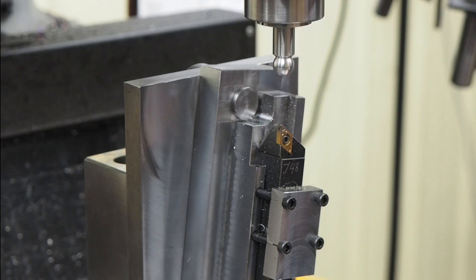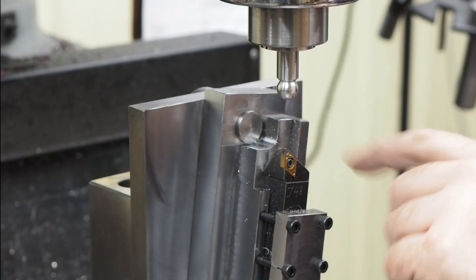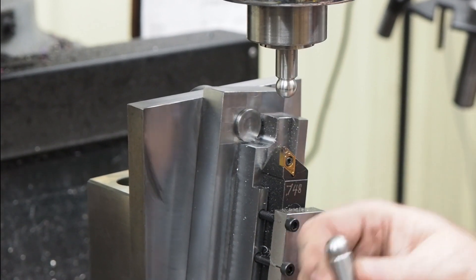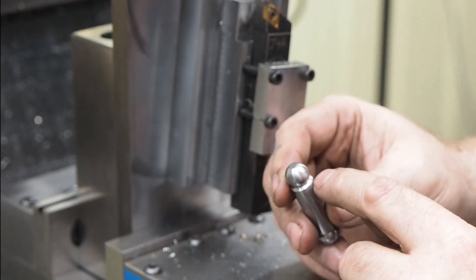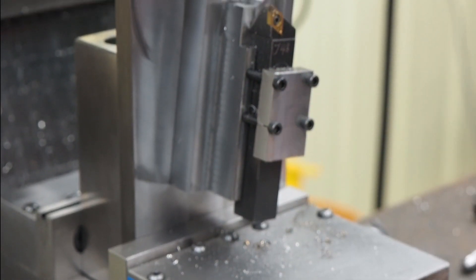And there you have it - just a real nice precision ball that's already turned. I can leave it on the shaft like here, hold it in my V-block, drill and tap it quarter-20, and then take it to the saw and cut it off. I only need to pivot on this first part here, and it would be good.